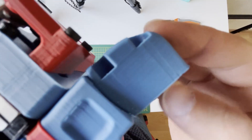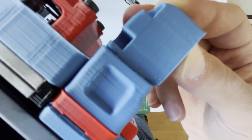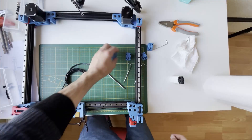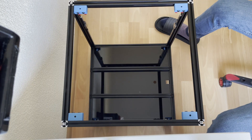This will be connected like this, and this will be the pivot point, so there will be a small movement gap for the gantry. First I will apply a little bit of grease in here to help with friction. While screwing these two parts together, don't tighten this screw too much. Now I will install this on the carriage — we will use M3 by 30, four of them for each.